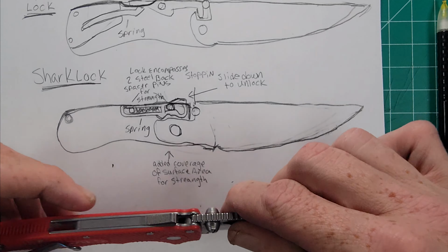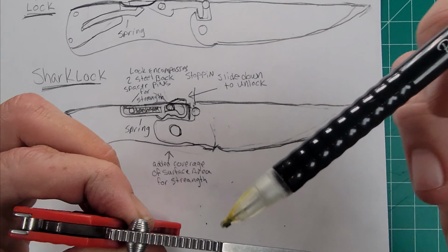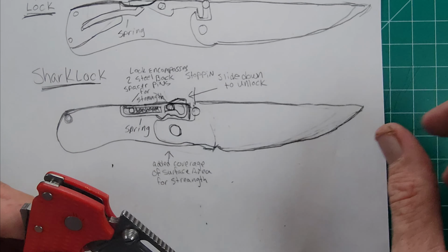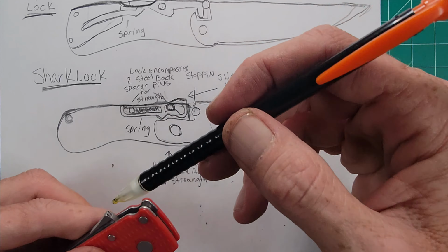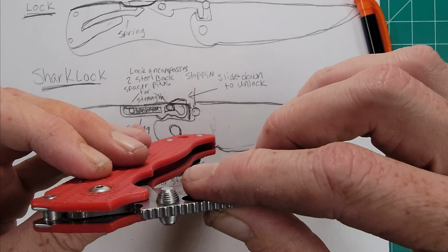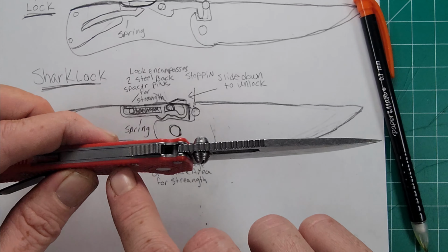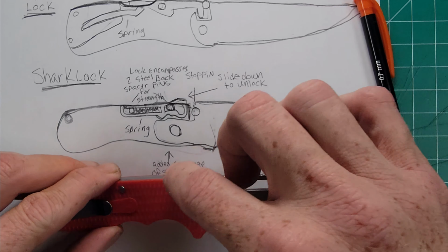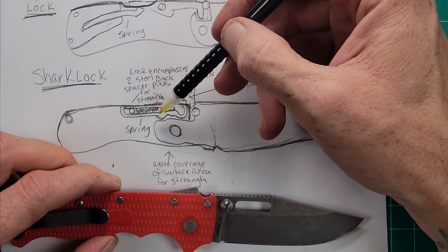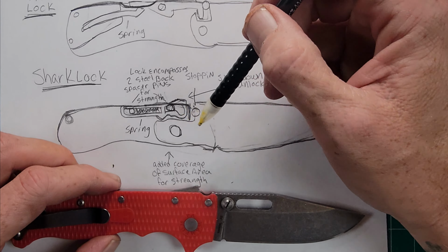And if you want to look, there is quite a bit of flat right here. All of this flat surface is what's going to come in contact with the underpart of this fin right here. And to me, that looks like 1/4 to 1/2 of an inch of steel that is getting put underneath that locking mechanism. And also, as the metal wears down, he has designed it to where it'll actually push itself, seat itself further in place, making this lock stronger the more you use it.